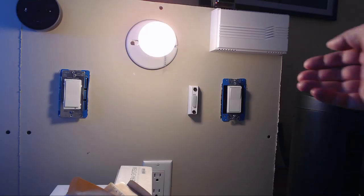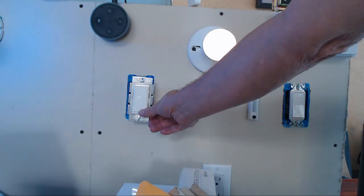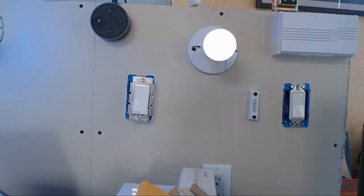The drawbacks I see: number one, you get that funky three-way switch operation from the manual switches in a three-way configuration where up is off and down is on. That's how three-way switches have pretty much always worked, so it doesn't really bug me. The second issue is with the Zen 27 dimmer — when you want to dim, you either have to use your hub, your app, or go to the switch itself. The three-way manual switches will not allow you to do any dimming. But other than that, I really don't have any complaints.